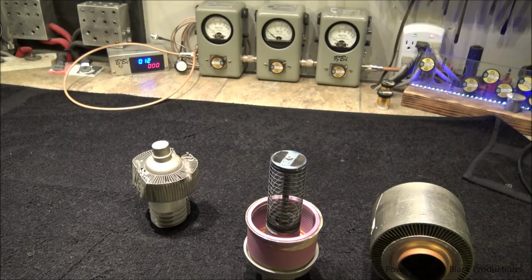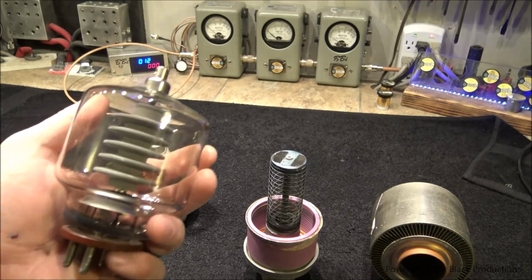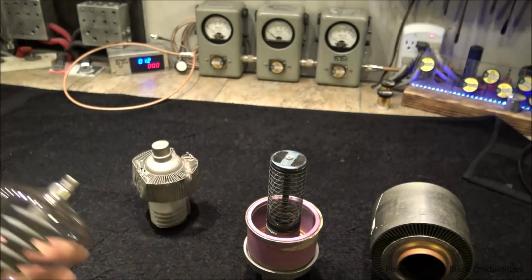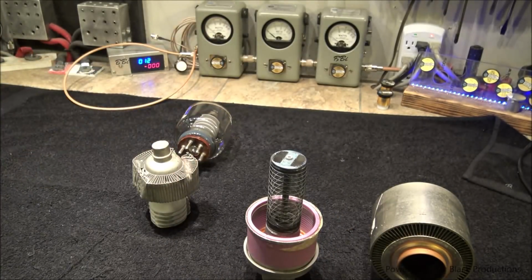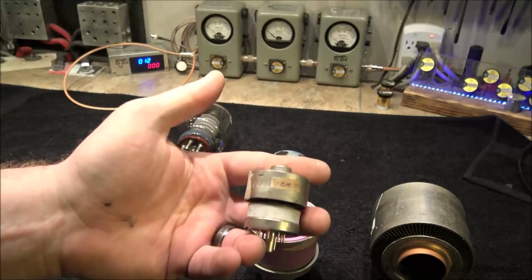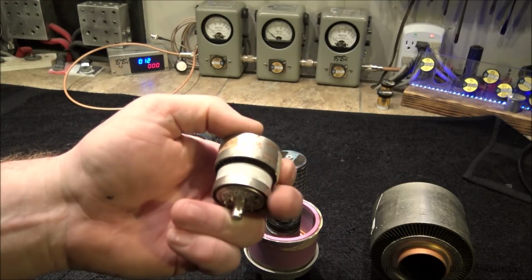Now, what happened along the way is we had to figure out a more efficient way to make a tube. So we had glass-bodied vacuum tubes, and when they figured out they could put the anode on the outside of the body, on the vessel, we started seeing the progression of this. Like, this is a small ceramic tube. This is a 3CX3000B.